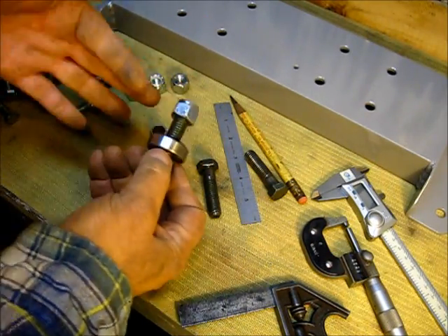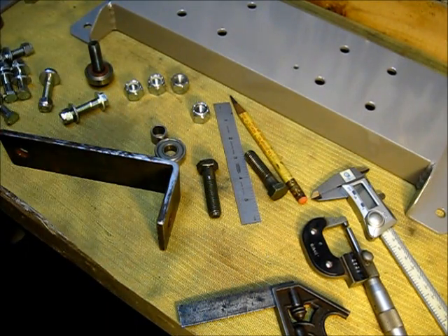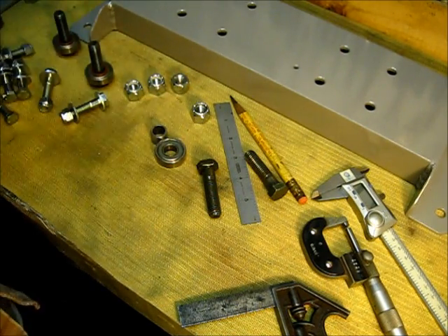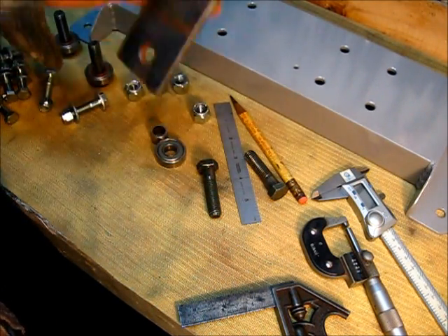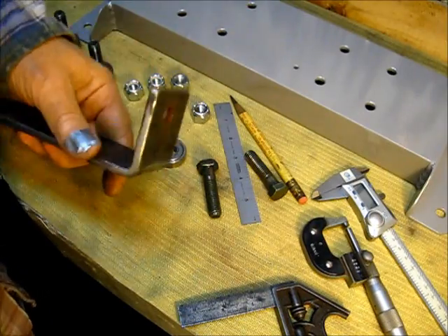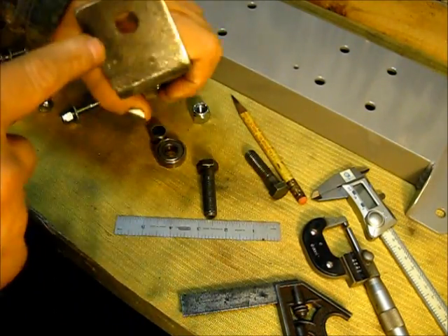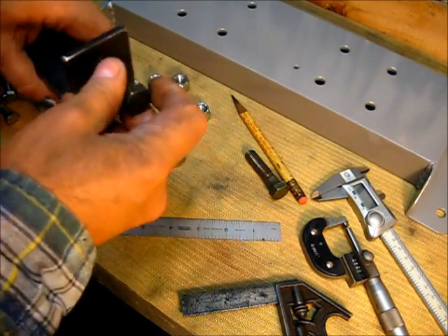With that criteria in mind, here's what we're going to do. I bent this thing up — this is just one of many fixtures for the little four-by-six Harbor Freight bandsaw. This is just one of the labor-saving things that you do on a daily basis, make them and throw them in the box and use them later. This is regular old scrap steel, two inches wide, quarter-inch thick. I drilled a hole in there that is a nice pleasing fit for that bolt — a standard half-inch drill bit goes right in there, no slop.